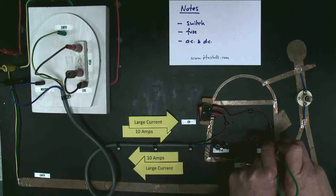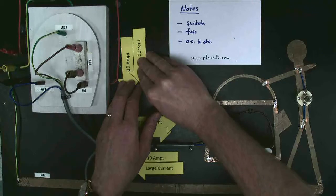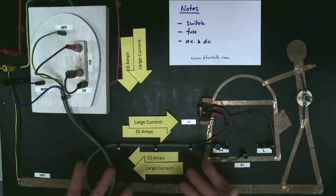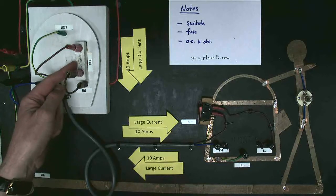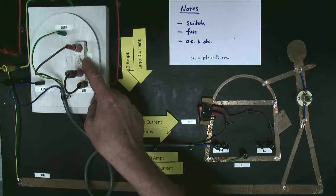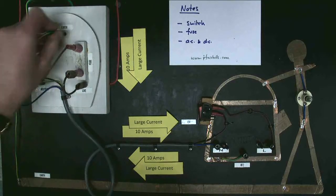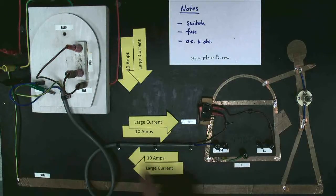Why did the fuse blow? The fuse blew because of the extra large current flowing through it — but that same large current would also flow through the house wiring. If we allowed it to carry on, the wire would do what the fuse did: get hot, like a heating element. If that wiring is inside the walls of your house, you don't want it glowing red hot — it's going to cause a fire. So the fuse also protects against live-to-neutral faults that could cause the wiring to catch fire. This is particularly important for double-insulated devices with plastic cases that have no earth wire — they still have a fuse to prevent this large fault current from melting the cabling.